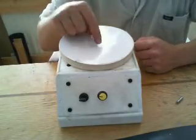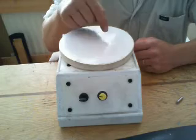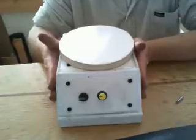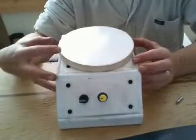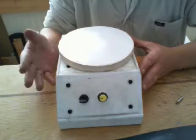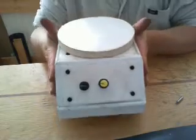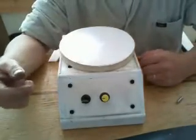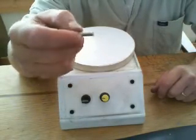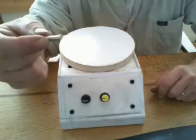Now, you remember the rotor in the middle — I had to adjust the magnets. What you want is the magnets directly down the centre line. If you don't get them down the centre line, the stirrer bar will just jiggle up and down and not rotate round and round. So I had to move the magnet so that it was directly over the centre line. This thing will also move about and vibrate because there's a motor in there that's spinning, so what you want to do is add some chunks of something heavy inside the box. I have some roofing lead left over from a previous job, so I beat the lead into little nuggets and stuck them in here to give this quite a lot of weight — that holds it pretty firm as the thing spins. The stirrer bar is just a little bit of magnet, and all I did was wrap it with sticky-back plastic, heat the ends, and then press them to seal it over. So that's actually a plastic-coated magnet now, and that's my stirrer bar.